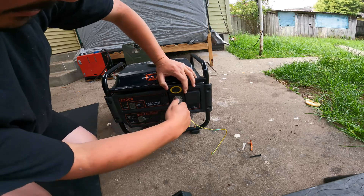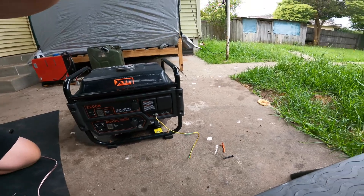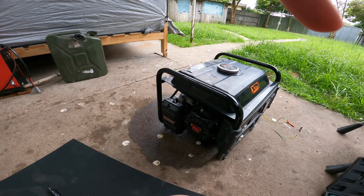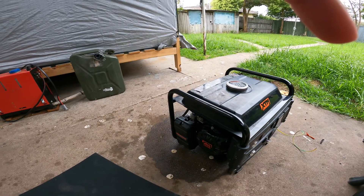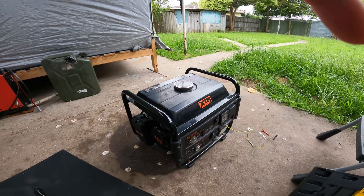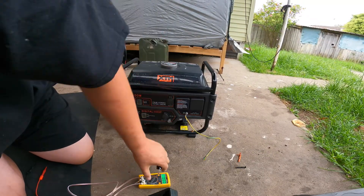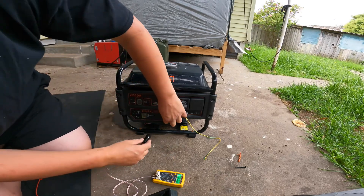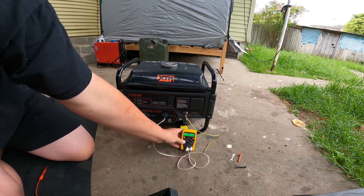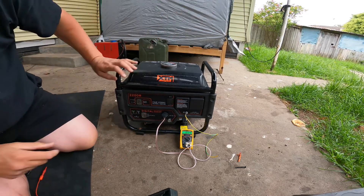I'd say the inverter module is shot, but let's see if we've got 12 volts. While I was inside trying to find a lead I discovered it's leaking fuel, which is not great — I'm going to have to relocate this before I fire it up again or it could catch fire, so I'm making note of where my fire extinguisher is. I'm trying to block the wind as best I can. We have a multimeter here on the 20-volt range and a lighter plug — that should let us see if we get any volts on this. Let's fire this up again and hope we don't ignite the pool of fuel.